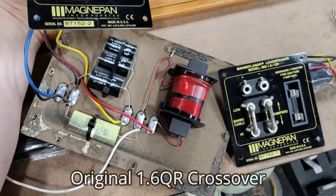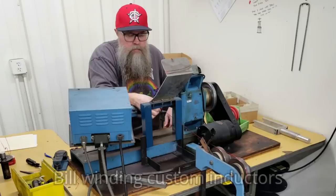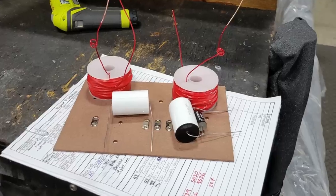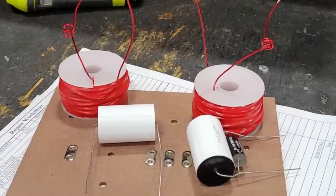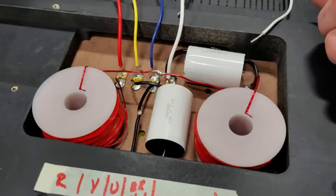The 1.7Is don't employ wires like the older models, but rather thin foil, which has lower mass and is much less likely to come loose again. Next, they tackled the crossovers. The original iron core inductors were replaced with air core units to get a smoother overall frequency response. An equivalent value air core inductor would be physically much larger and wouldn't fit in the crossover space, so Bill custom wound two small coils that equaled the value of a single one — which did fit. They also replaced the old capacitors with new copper-rich polycaps.